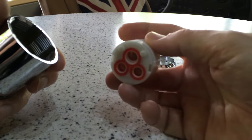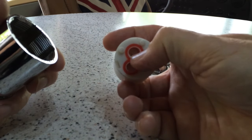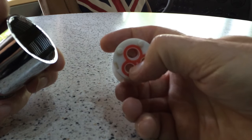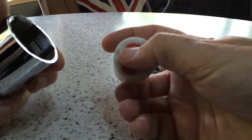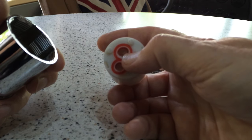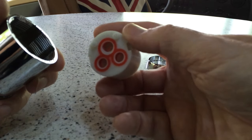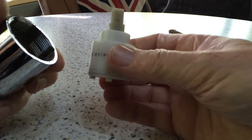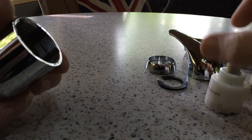The actual sealing part is this multi-circular o-ring at the bottom of the cartridge. If you want, try putting some Vaseline on it and putting it back together — that might be worth trying before you buy a new one. But for the sake of the money, it's probably worth just replacing the cartridge, which may be fifteen to twenty pounds on eBay, a little more through authorised dealers.